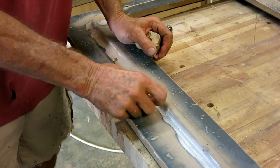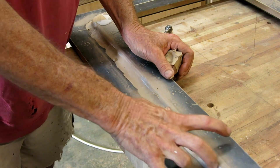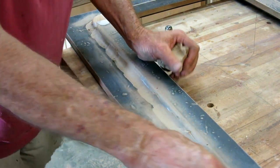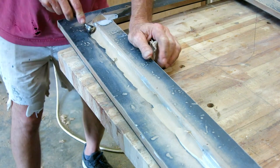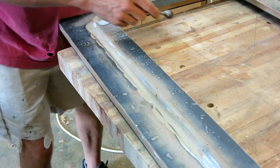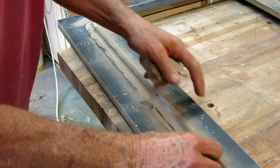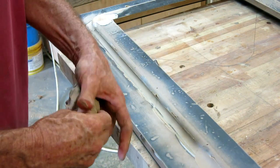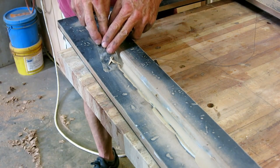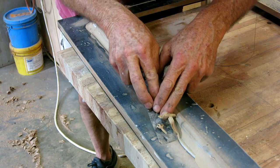Picked up a new trick on YouTube this morning. This is oil-based clay - it doesn't dry out and crack like water-based clay. I'm trying to make a nice smooth chamfer into molds so that when I do the glass it will come out with a nice shape. It basically does what a tongue depressor does - it makes a nice curve. But because it's steel, you can push on it really hard and it's not going to break. And because it's round, it really doesn't matter which angle you hold it at - it's going to make the same nice curve whether you're pushing or pulling it.